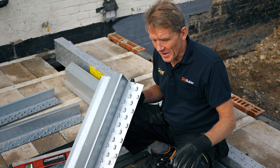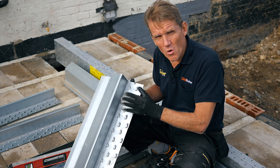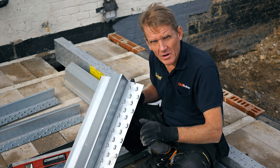Here's another one that I see people getting wrong quite a lot: you should never place a point load on the flange of a lintel. Always have a minimum of 150 millimeters of masonry over the lintel to spread that load.